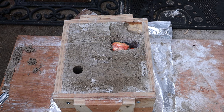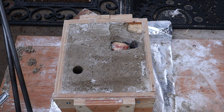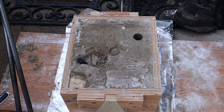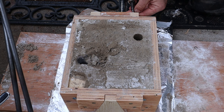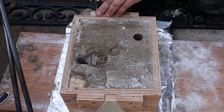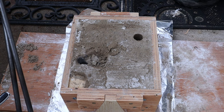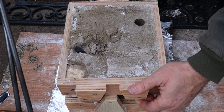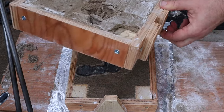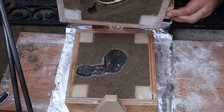One thing that I think is pretty neat right here is you can actually see the metal on top cooling right before your eyes. Before I had started, I screwed together both halves of the box so it couldn't come apart while I was pouring the metal. So I had to take the screws back out before I could take apart my two-part mold. You can see the scorch marks in the bottom half of the box, and the casting itself actually stuck in the top half.